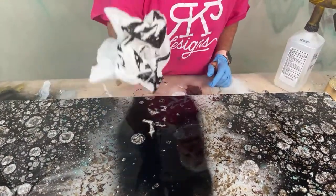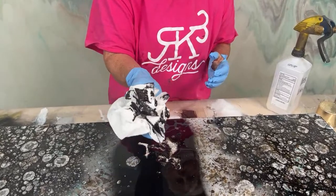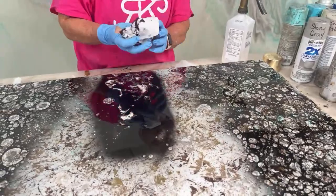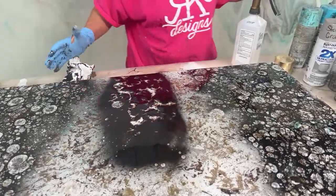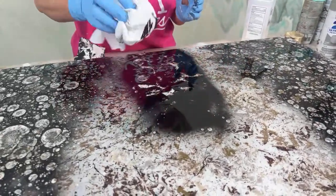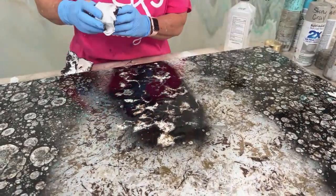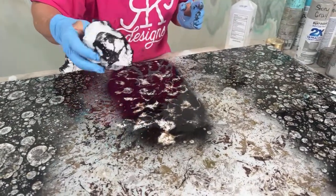But you can't go back in with a dirty paper towel. So each time you tap, you're going to have to turn your paper towel. And you can pull it off. All right. So you can tap it off. Now, the thing is, you can't do this more than, say, once or so, because what will happen is you're not only pulling that paint off, you're pulling epoxy off as well. So if you do this too many times, you're not going to have enough product on the surface to cause a reaction.